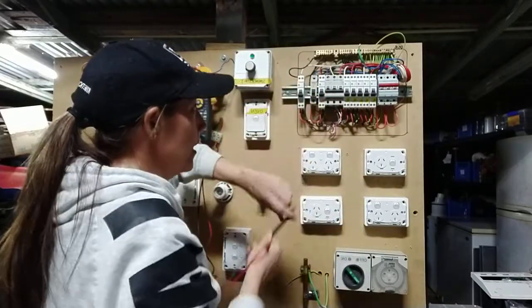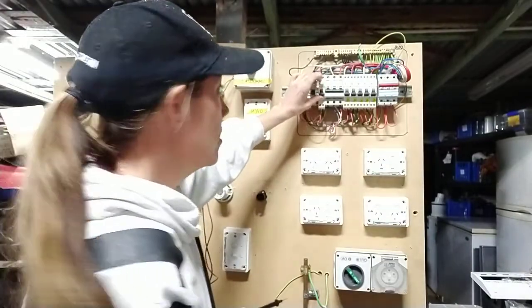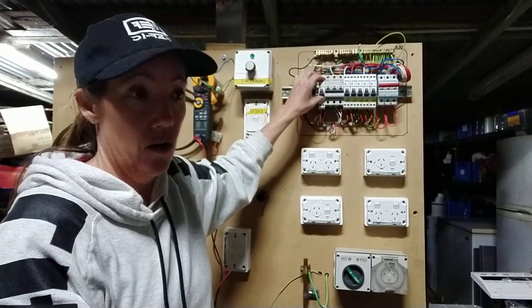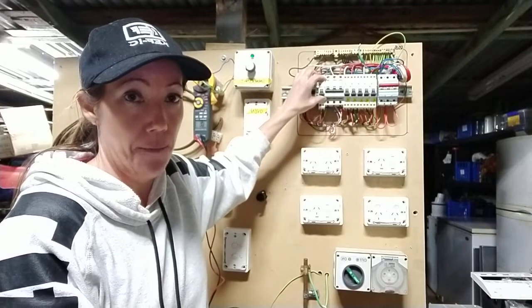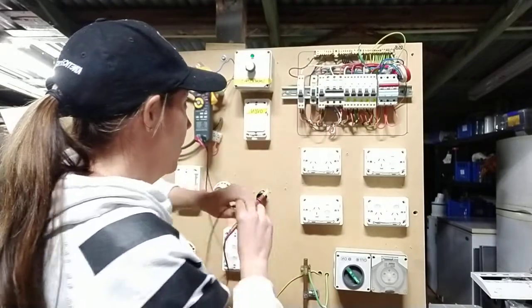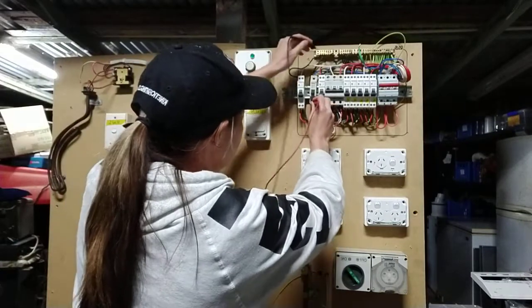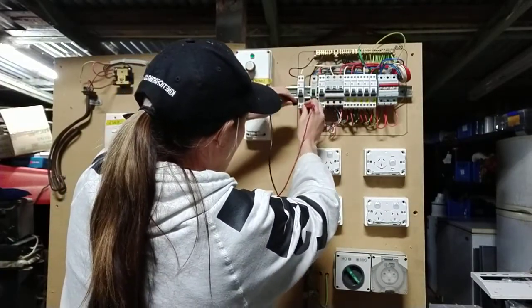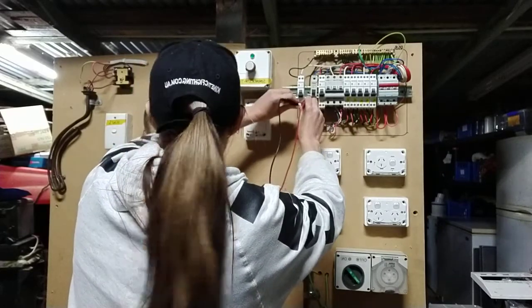I've got a reading on this one — that's actually my oven. It's a resistive circuit, so I'd expect to get a reading. I'm expecting to get a resistive value of V squared divided by P, that is voltage squared divided by power.